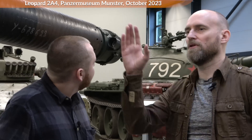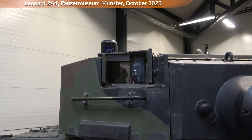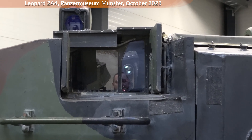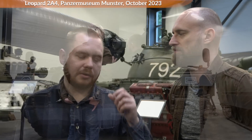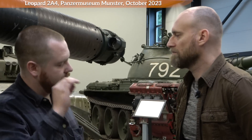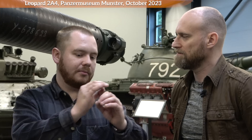So you look through it with the EMES — the main gun sight. With the EMES, yes. You have to know you have a sight that is coaxial and not movable, but with the other one it can move independently from the gun, because it's part of the fire control system. There's a lever on the optic that you flip, and then the optic aligns automatically to the barrel, and then you can check it. You see two optic images over each other and you have to bring them into alignment.